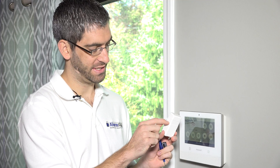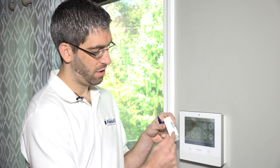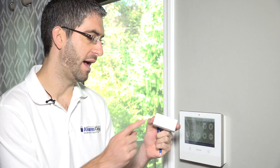The device's very distinct characteristic is these four ridges. If you're ever unsure of which sensor you have, if it looks bigger and boxier like this with the four ridges, most likely it's a 5816 sensor. It's by far the most popular sensor you'll find with a Honeywell Wireless system because most kits sold include three of these. We prefer the flatter 5811 sensors, which have roughly a quarter inch depth, whereas this one's more like an inch and a quarter, so this one doesn't blend in quite as nice. But if you have a system from somebody else, most likely you got this 5816 sensor.